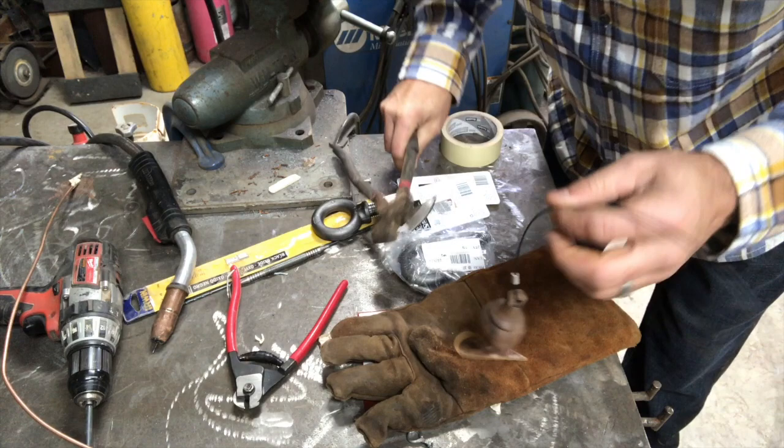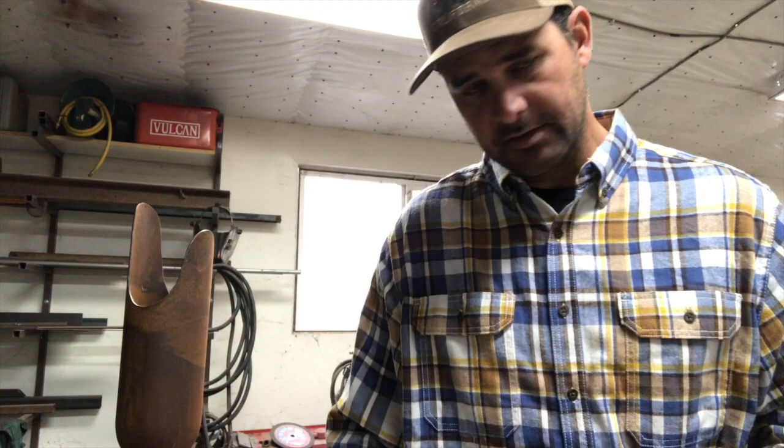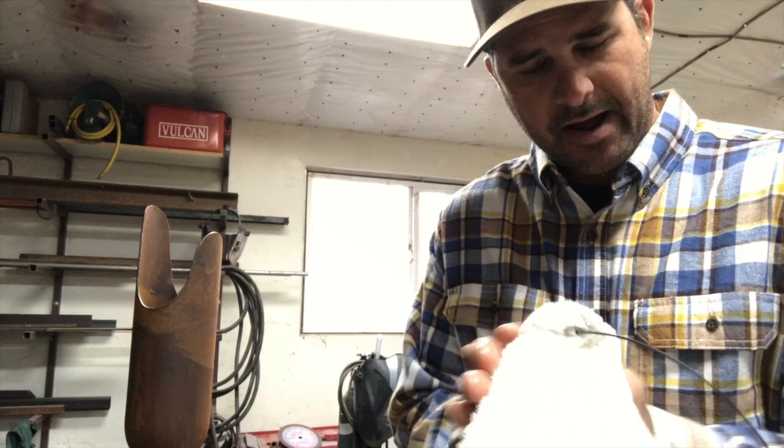Before I put this in there, I do want to put a finish on the wood itself, and I just use this wood paste finish wax. It goes on pretty easy — you wipe it on, let it dry, wipe it off, and you can put a few coats on. I like to put it on real thick at first. After you've waxed it up and waited a few minutes, go ahead and take a nice clean rag, get in there, and just rub all that wax in and off. If you give it a nice kind of a buff, it'll actually shine up.